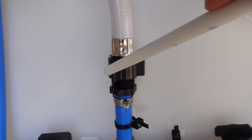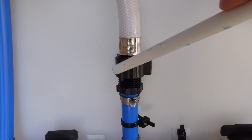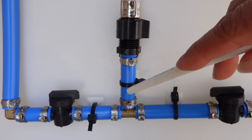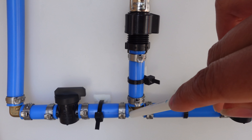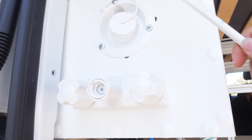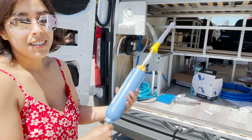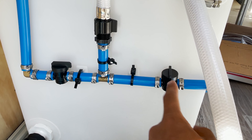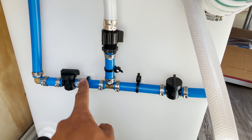From the pump it's going to go back into the silencer tubing. Right here we have our SharkBite half-inch PEX to half-inch MPT adapter, which brings it down to our SharkBite half-inch PEX tubing, which goes into the T. Then that's going to separate it to our outdoor shower, which doesn't use any heat — this is just for if we need to wash off after diving.